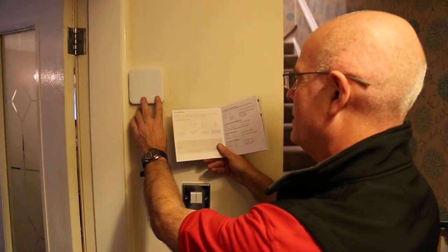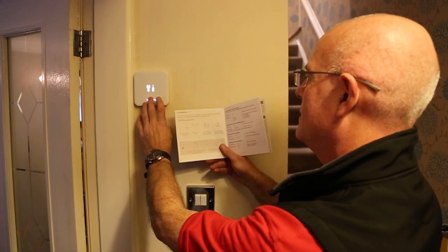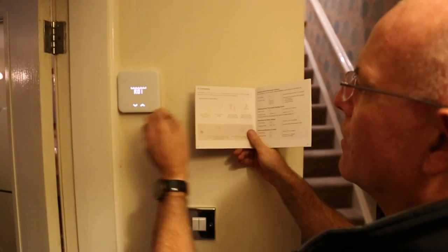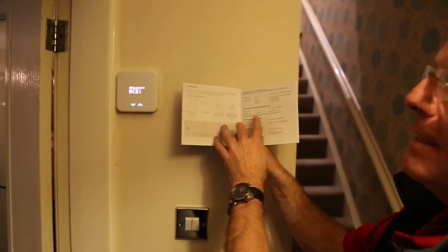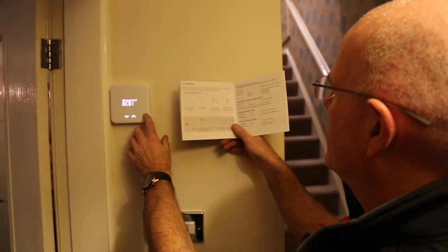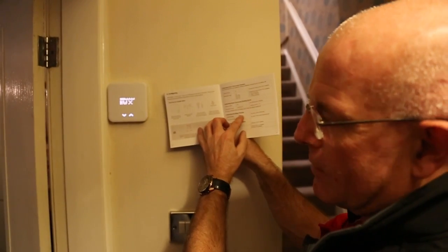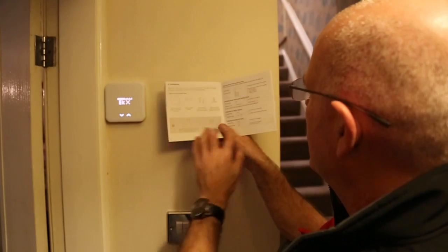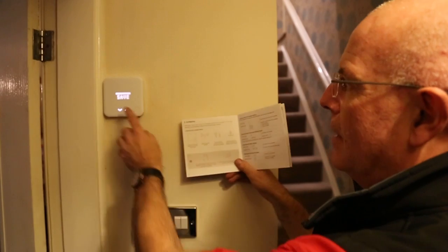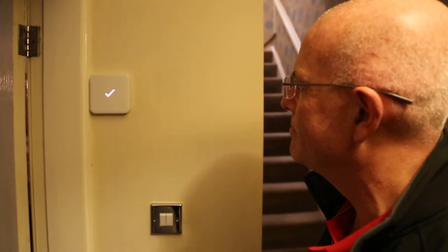As you see here, you press and hold the button on the smart thermostat until the antenna symbol appears. You then push the button quickly 3 times. This section we want to tell it to use the relay, so it's R01. So now you're selecting the smart thermostat heating circuit, which would be HC01 in this example, which is heating circuits 0 to 10. If we then press the button again, we see the hot water. In this instance it's hot water X, because we aren't controlling the hot water. And then this is for the extension kit, and because we haven't got an extension kit, you'll be showing an X there. And then we see the save button, and we'll just press save, and it's uploading the settings, and then you get the tick, and it's all done.